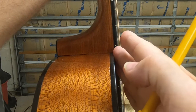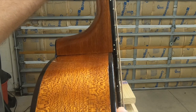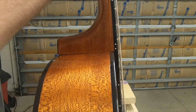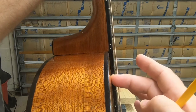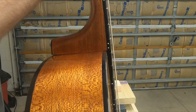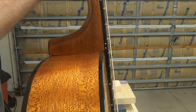I am NOT going to focus at all on the thickness of the upper bout, because frankly it doesn't do anything sonically. Most of the sound comes from the lower bout where the bridge is, and it's more open. This area actually has a block underneath it, so that is the change I'm going to make — I think when I do, I'll have a better fit where the fretboard meets the body.